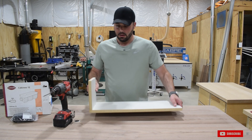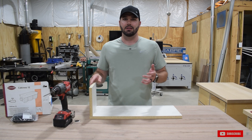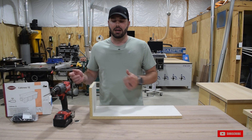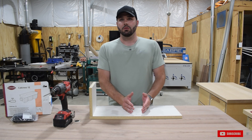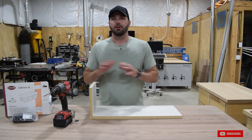This system is super efficient and super quick — it allows you to transport everything flat, especially if you're thinking about doing custom closets. It's going to be hard to move big pre-built pieces of furniture through someone's house, so think about how you can take everything in flat. No thinking required — just line it up with the holes that have already been drilled for you, grab your drill, get everything assembled, throw some caps on if you need to, and you're done.